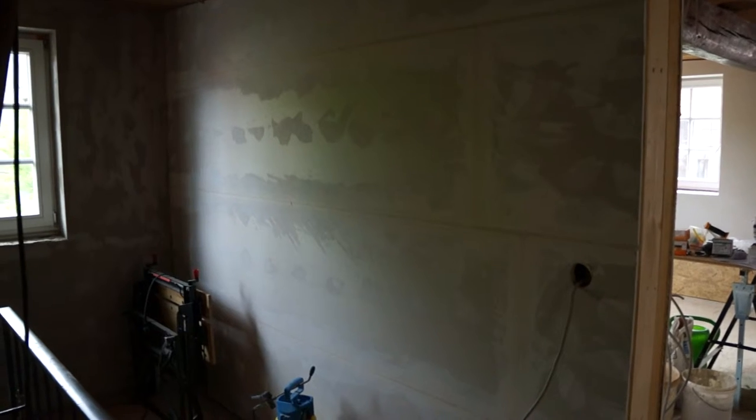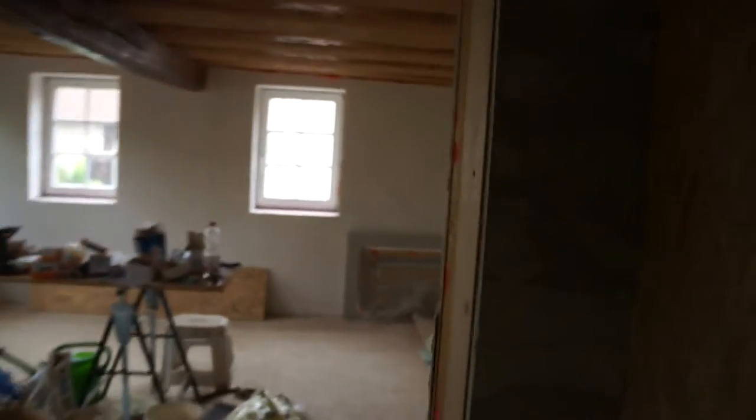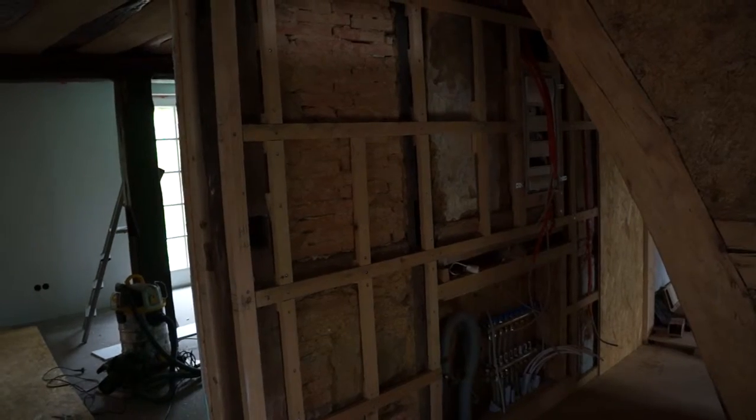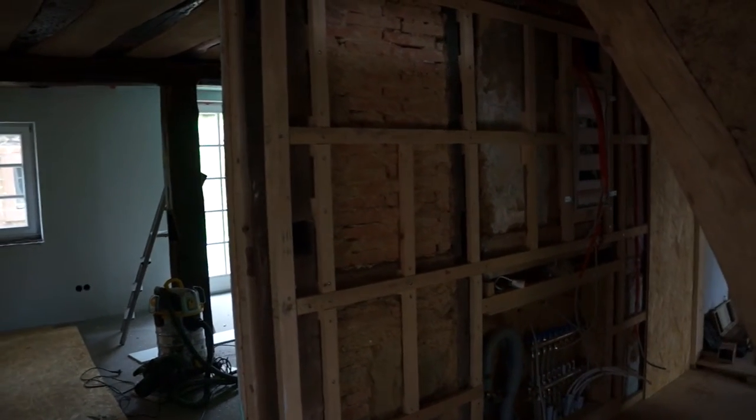And on the other side of this wall, just yesterday I did the jointing here, and on Friday night I completed the plasterboard — there's OSB sheets and then a 12mm plasterboard on top. So that might get the skim treatment. And that means in the hall, I just have to complete this part. There were some cables in the way, they were removed yesterday, so ready to do that. That would mean the hallway will look less like a building site, because when people come up the stairs and are faced with this kind of site, they go, 'Oh Jesus, they're never going to finish.' So that'll make a big difference.